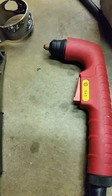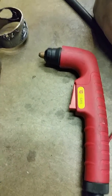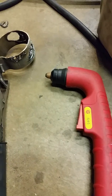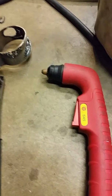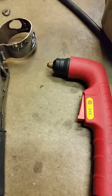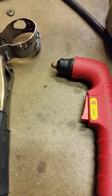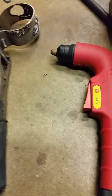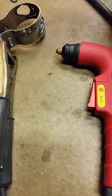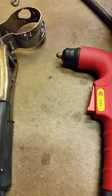The third relay is the one that actually turns on the transformer. It's slightly premature — if it actually did it the other way around, if it started the transformer and then blew back the electrode, this would work. But I don't know how to change that order, so I guess it's back to the drawing board, or get the proper torch — which no one has been able to tell me exactly what the proper torch is for this older model.